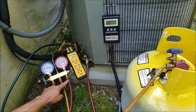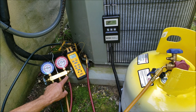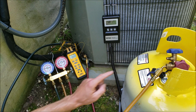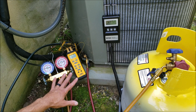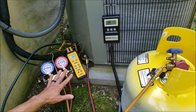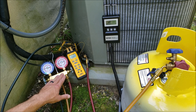We would use the high-side pressure over at the liquid line, and where it connects into the gauge set we would open the handle slightly in order to allow the high-pressure refrigerant to come into the recovery tank a little bit at a time. This method is only used for adjusting the refrigerant charge slightly in an overcharged scenario. We don't want to use this method for recovering a large amount of refrigerant because you're going to accidentally remove the oil out of the system, since the oil is thoroughly mixed with the refrigerant while the system is running.